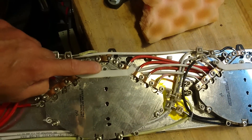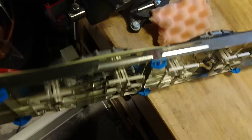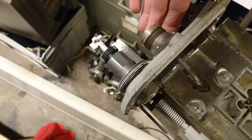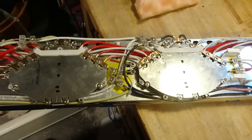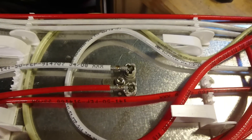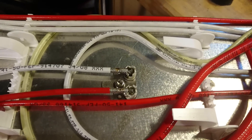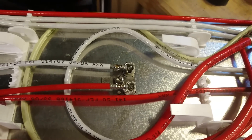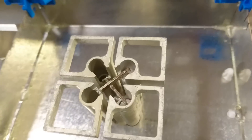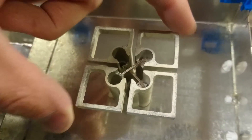As you can see here, there is a little plastic nut which is controlled by this white plastic band at the bottom of the picture, which goes down to the crank at the end. What this does is it can actually adjust the phase shift in these two phase shift modules by 0 to 15 degrees. On the back, we can see how each antenna dipole is connected from two different phase shifters — the red and the white. You can see the two wires coming through and the signal bridging over, so you have a dipole from these two elements.